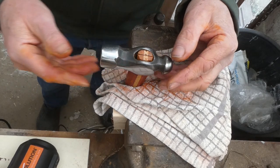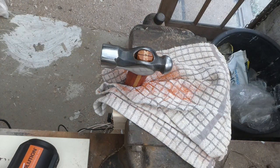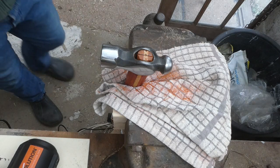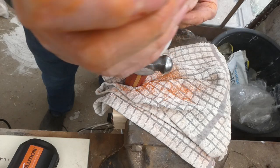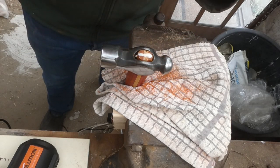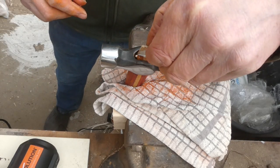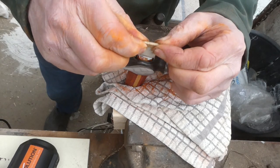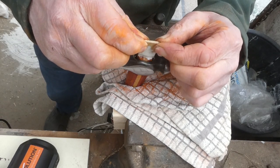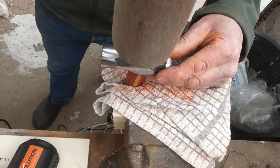There we have it. Here I'm putting a saw cut down because I'll be putting a wedge in this — it's a lot easier if you've got a saw cut there to allow the wedge to go in. It is a little bit of a sloppy fit — I just got a little bit carried away. It's really difficult because the inside of the head where the wood fits isn't sort of parallel, so to get it to go in it almost inevitably finishes up a little bit on the sloppy side. But there's nothing that can't be fixed — the wedge will open this up, certainly to the sides. My intention was to put some metal wedges in the opposite way but I hadn't got any, so the wooden wedge will suffice.